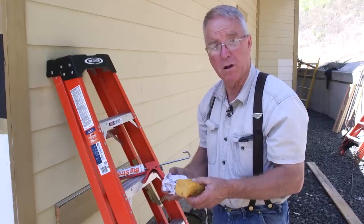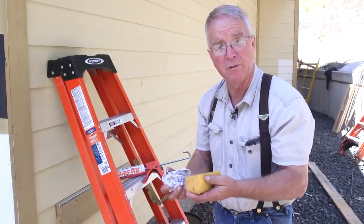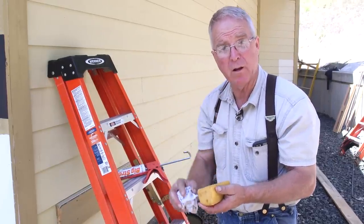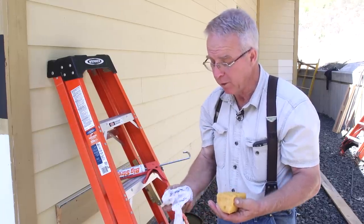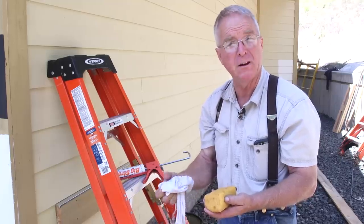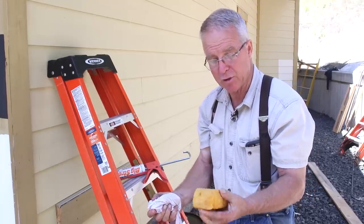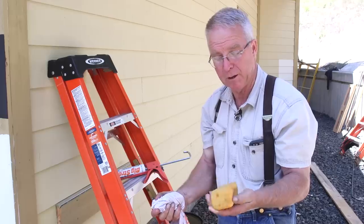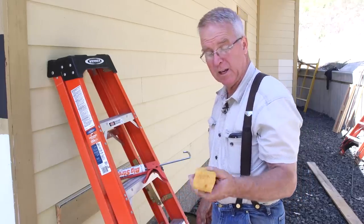With most paintable caulkings, you're gonna have to have a bucket of water and something to do the cleanup as you go, including to strike off the bead after you've laid it in there with your finger, if that's what you're doing. For years, I've just used an old piece of a t-shirt and it works all right. Lots of pro painters just use a piece of fabric. But Nate's friend Rich dialed him in on using a piece of a sponge, so I cut off the end of a grout sponge. I've been using that, and I gotta say, I really like it.